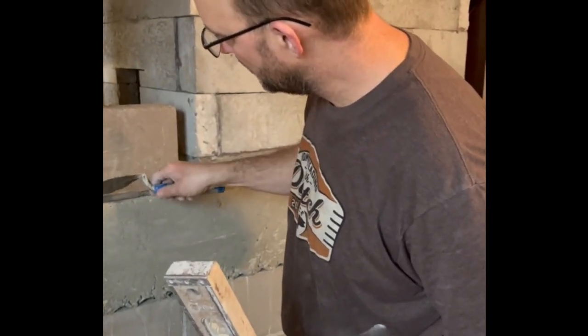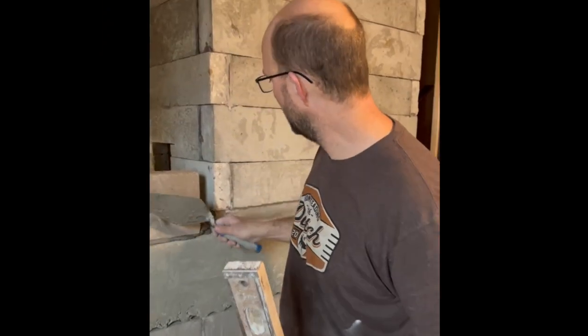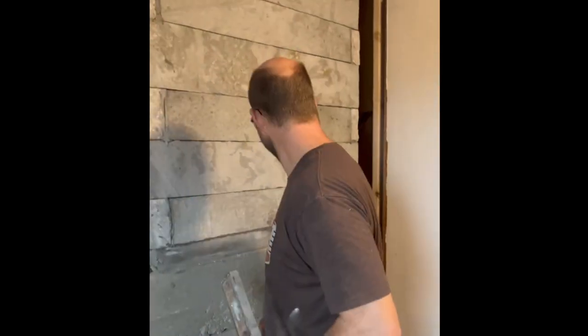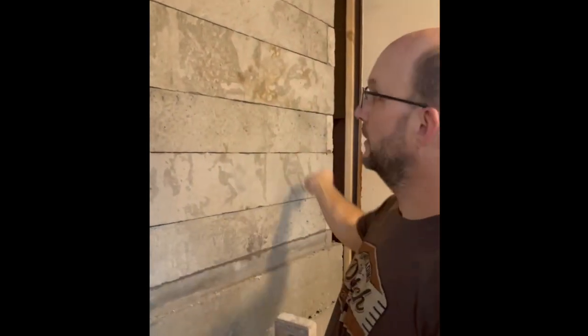Wood storage box, how you're building it. So concrete board and the box. Yeah, we're on the back side of this heater, and this is going to be the wood storage box area, so we're just going to run a wing wall all the way from this wall over to the heater. This whole back side will get stuccoed, and it will just take on the appearance of the interior of the room. It wouldn't be known to anybody unless they knew there was a heater here.